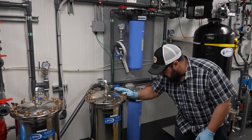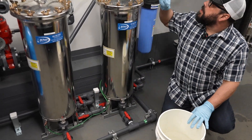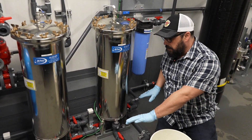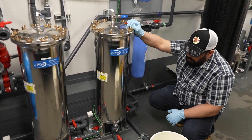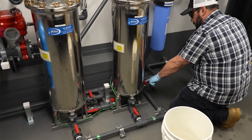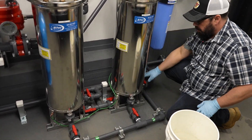How this works: you've got an inlet coming in one side and then you have an outlet. We have two here because as it comes down to our unit, it splits off and filters both canisters at the same time. To isolate one of them, you shut off your inlet, you shut off your outlet, which is on this one, and you also have your drain right here.